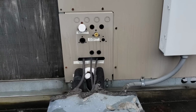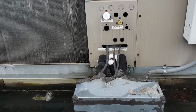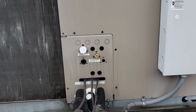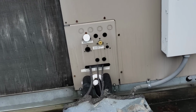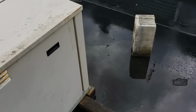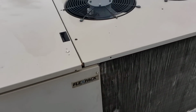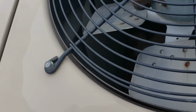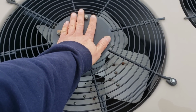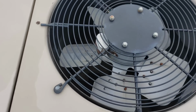And there's only one cooler that I'm aware of, and this would be about right over top of the walk-in cooler and the walk-in freezer areas. So pretty sure this is our guy, which doesn't really fill me full of confidence. See, so I wonder... yeah, that's pretty warm. So that condenser, I'm pretty sure it's just dead.